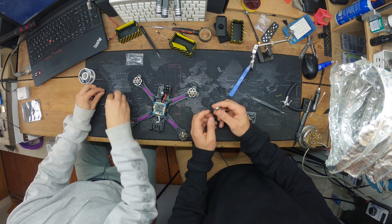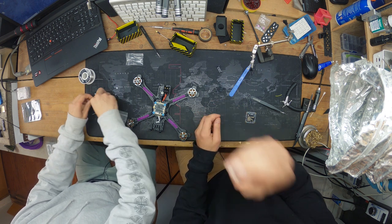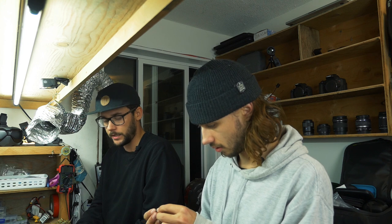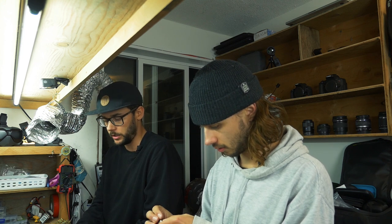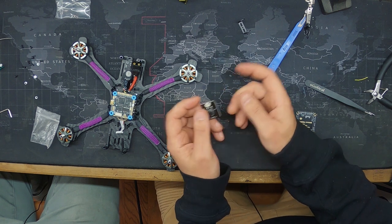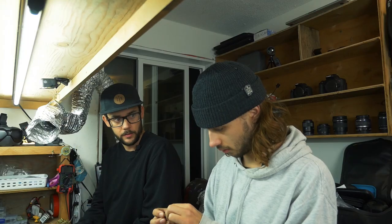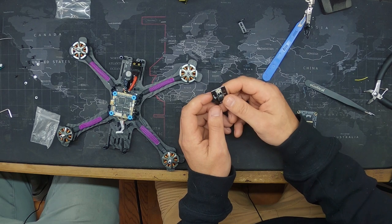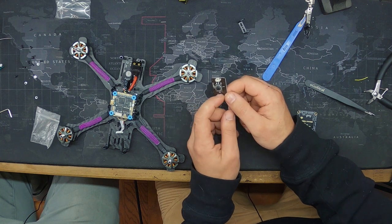This is so that if you plug this into the back of your camera and push on the Caddx, it gives you a menu and you can change the saturation, the sharpness, the white balance. You can get into the back end settings of the camera, things you wouldn't be able to change without this. Obviously, if you have a pair of Fat Sharks, you can just change the contrast and brightness. But if you really want to get into the settings, you can push this. Especially if you wanted to use this Caddx as a nighttime camera, you'd set it up for black and white.